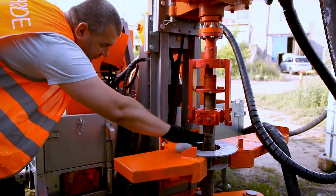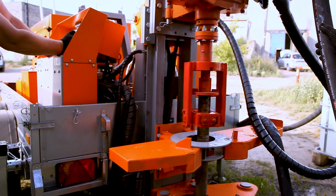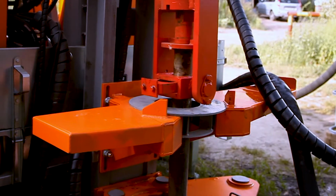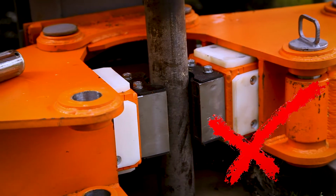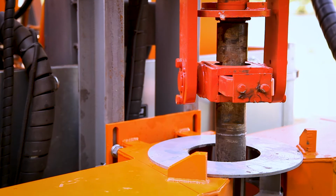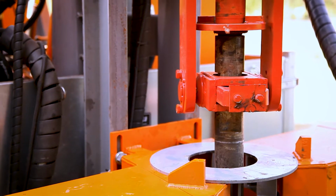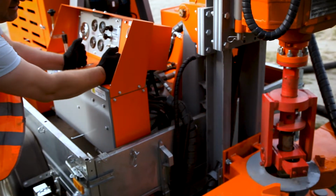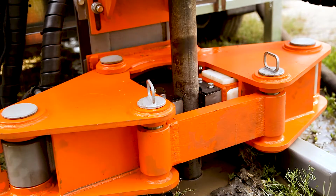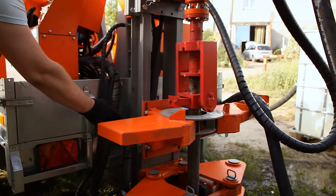We drill under the second flat of the pipe locker. It is needed to make it easy to connect the next pipe. Now we fix the drilling pipes by the drilling pipe clamp. Now after we fix the drilling pipes by the drilling pipe clamp, we disconnect the rotary head. So start to disconnect it slowly. Now we have the drilling pipes fixed by the drilling pipe clamp.